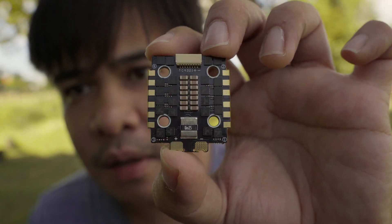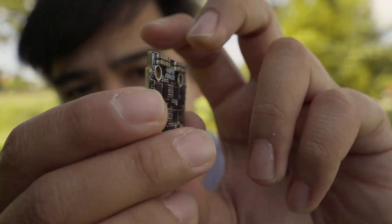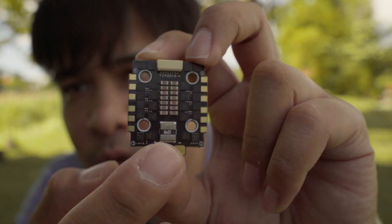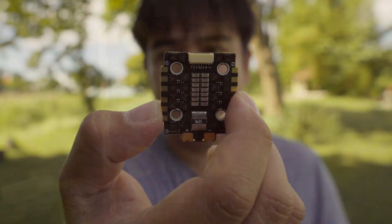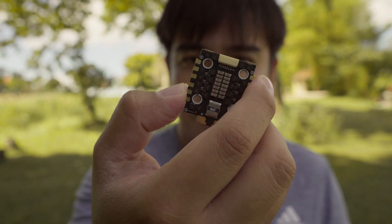The main board looks nice — everything is baked in cleanly. On one side you can see a conformal coating from the glossy reflection. The markings on the board tell you where the main leads go and label the motor wire pads by motor number, so a pinout diagram really isn't necessary. Specs: 3S to 6S voltage, 45A continuous current, 55A peak burst current — you can run it at 55A for a short period without damage. It runs BLHeli32, has a 20x20 mounting pattern with 4mm holes, and weighs 9.2 grams per the website.